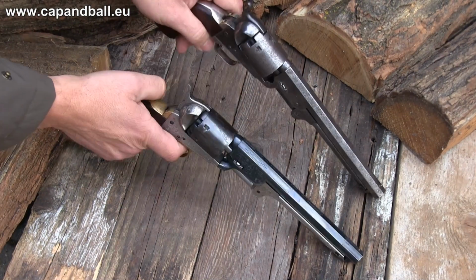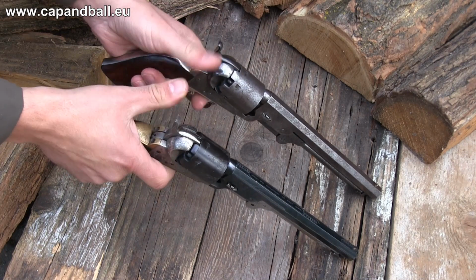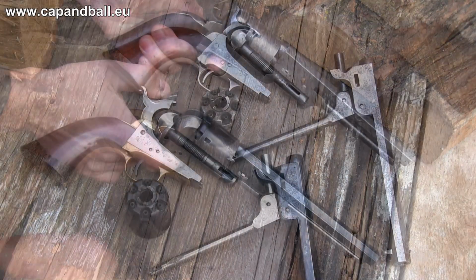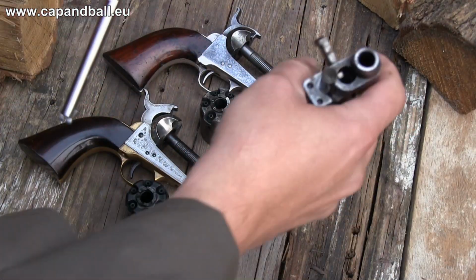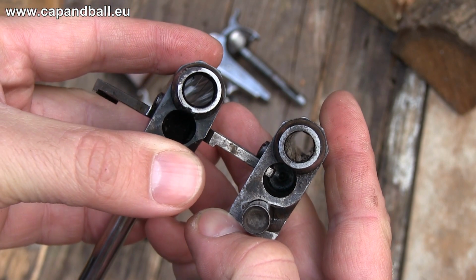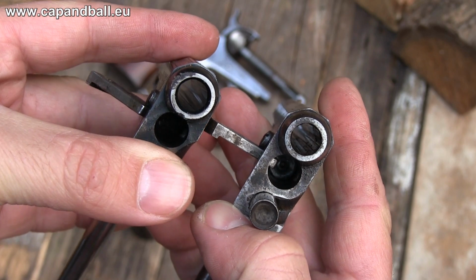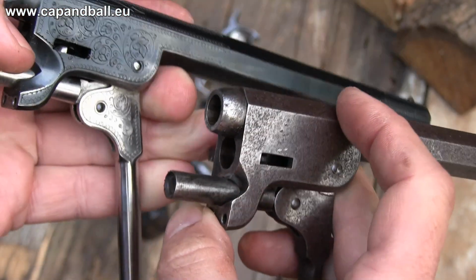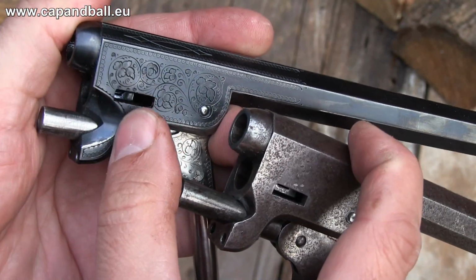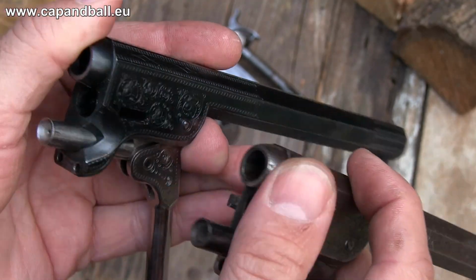The hold of both guns is very similar. Both the weight, grip size and feel of the revolvers are the same. The original has a gain twist rifling with a left-hand spiral and 7 grooves. The repro has a right-hand twist with 7 grooves as well. The groove-to-groove diameter of the original bore is .382-.383, while it is .370 on the repro. The loading notch on the repro is beveled, indicating that it is a fourth model.